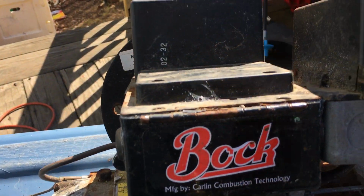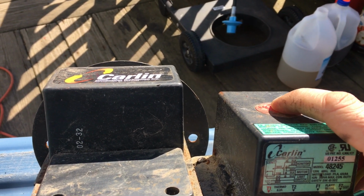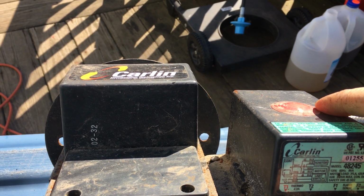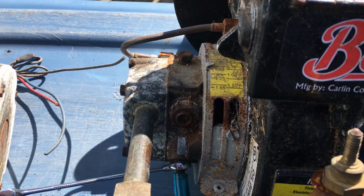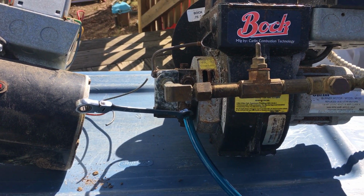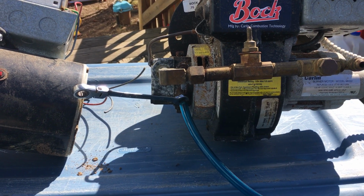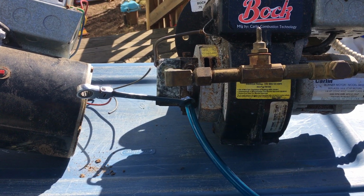Sometimes you have to hit the button 2 to 3 times. After you hit the button for the 3rd time, if you don't get all the air out, depending upon where your oil tank is, if your oil tank is on the far end of the house, you might get locked out of the system. And you have to unlock the system.